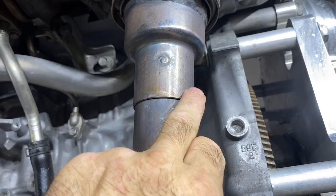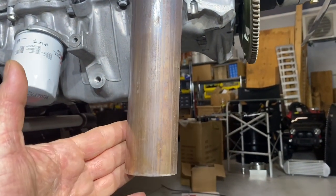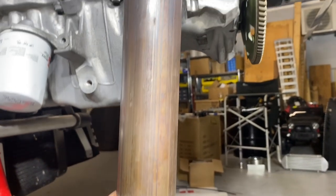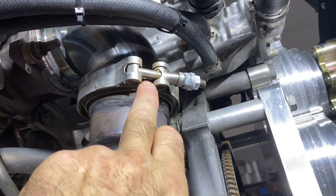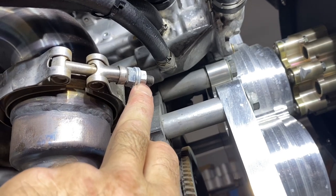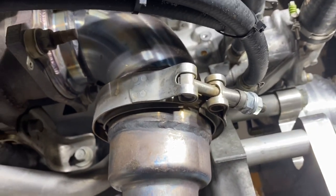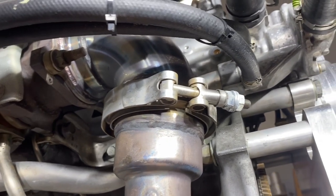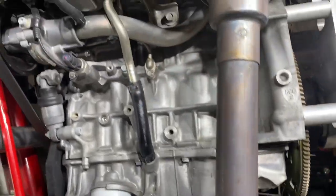This section is rosette-welded in three places so it won't have a continuous weld and will not fail. There's always movement in a tailpipe on an airplane — pulses from the propeller, air pressure — so it's important to design something that won't crack. This V-band clamp has two nuts, and you want to tighten it just enough that the whole system can still move a little bit. Leave it just loose enough for a little movement, then lock-nut it. That way the tailpipe is free from engine vibration.